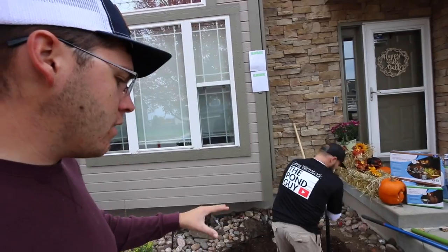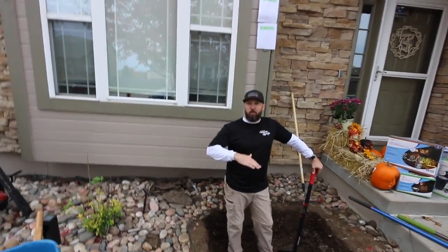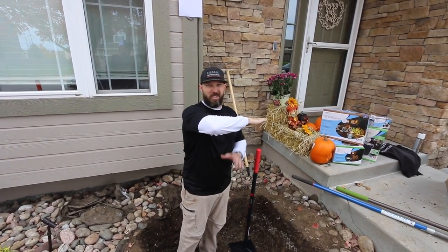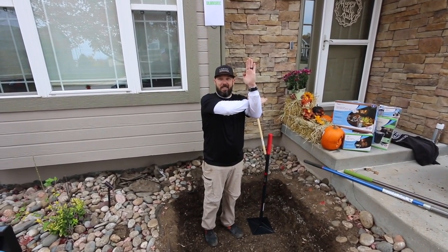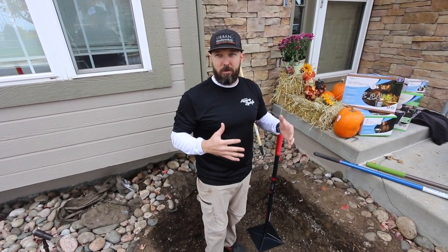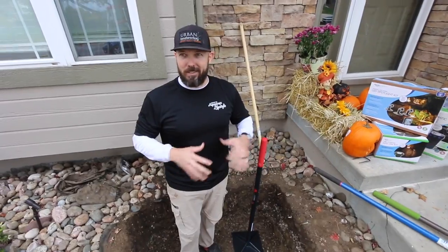You do enough of these, you eyeball it level at first. You can walk around and feel where it slopes, then rake it and fluff it up just a little bit, or add some sand. So whenever you put the water feature in, you want it level — our urn would only be coming out on the left side if it was tilted. Water is always going to level itself, so water will always rise level. If you've got a low spot, it goes that way. When you turn on the urn and it's not level, you'll see water going off to one side — all you have to do is shim it level. It's good craftsmanship. It's professional to level the basin completely all the way around. You don't cut corners, because those corners bite you in the end and then you've got to come back to an unhappy customer. Take your time — it's the last 10% that matters.